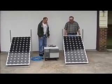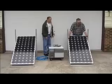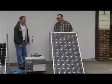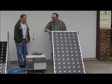As it's sitting right now, this is a 30-degree angle to capture sunlight in the summer. In the wintertime, when the sun is lower on the horizon, all we have to do is angle it up to 45 degrees, and you can get a better angle of the sun during the winter.